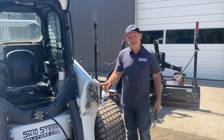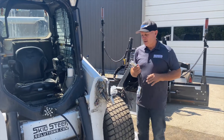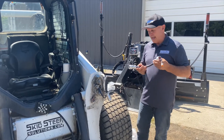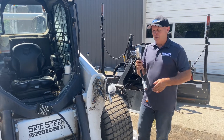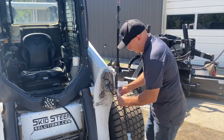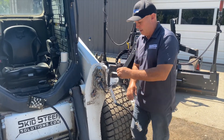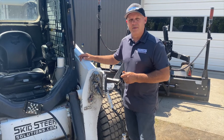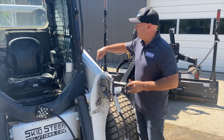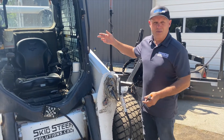I've got this installed with a couple of tie wraps. This is the 6014 — a six-output 14-pin controller that plugs into the 7-pin of the Bobcats. Now I don't have enough controls to run what I want to run, so I can add the SG-BC6-BC10, which is a 14-pin to 14-pin adapter. That part number means it comes in with six inputs and goes out with ten. We just plug this into here, and what we have is this little pigtail. This pigtail will plug into another controller that we'll install in the machine. This can be as simple as just throwing it through the door and plugging it into your cigarette lighter, or there's enough cable to run it through the machine, down through the boom, and pull it out through the access hole on the side.